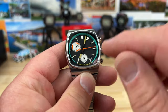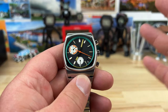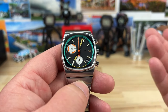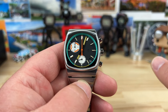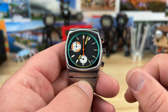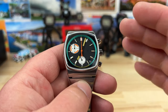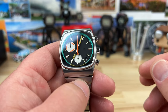It's been running for a while and you can see the chronograph hand and the sub-dial over here at the 9-to-10 o'clock position. So if I stop it and then reset it, you'll see it snap back — like an automatic or manual chronograph would. Now with this movement, the VK68, it does have a running seconds hand placed at the 6 o'clock position, with the date positioned kind of right in there — a little bit more towards the five, but right in there.